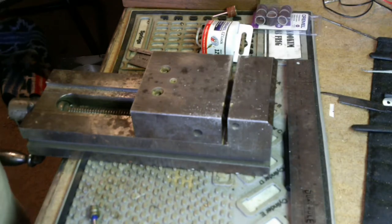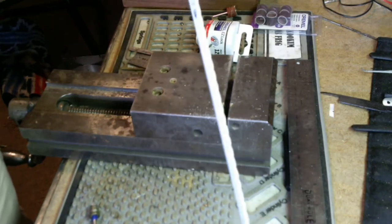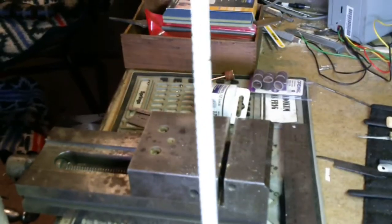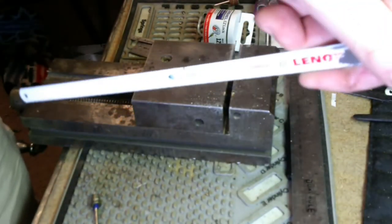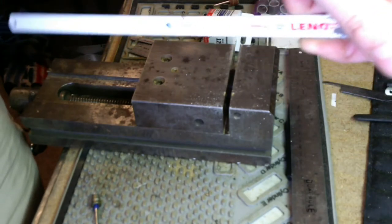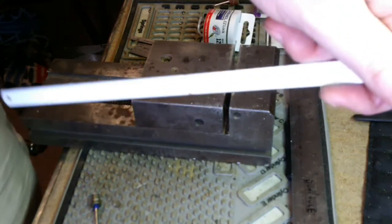First, you'll need some source of material for pick making. There's a few of them that are very easily found. The first being hacksaw blades, which is what we're going to use today. They're cheap. You get a two pack for like $4. Try to find the cheaper ones though. The name brand ones tend to be super tempered, which makes them hard to work with.